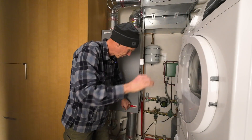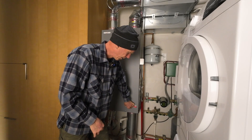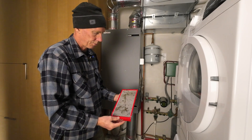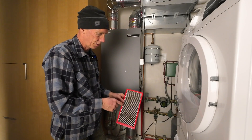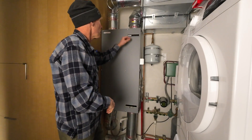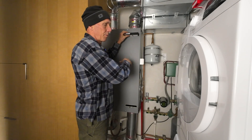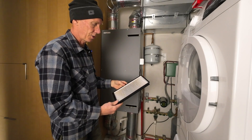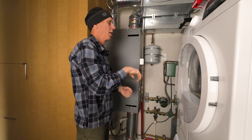So these are the two filter zones. The red one on the bottom here — in the way we've got it installed, it depends on how you have this thing set up — is the one that's taking the air from the outside and filtering it as it comes in. I change that out every six months. I'm kind of at three months right now so I can see there's some bugs in here. I'll just take an air compressor and blow this out so we can reuse it for the remaining three months. The one on top is the one that takes air from the inside and cleans it so that it doesn't clog up the air exchanger inside — so it should be fairly clean, and it is.